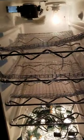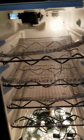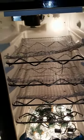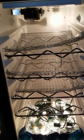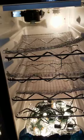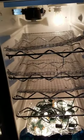See, okay. The heat just dropped below 99.5, so it kicks on. And once it gets to 100.5, it kicks off. I've watched it all day, and the temperature does rise to about 101.1 to 101.5, and then it slowly decreases. At about 99.8, it kicks back on.